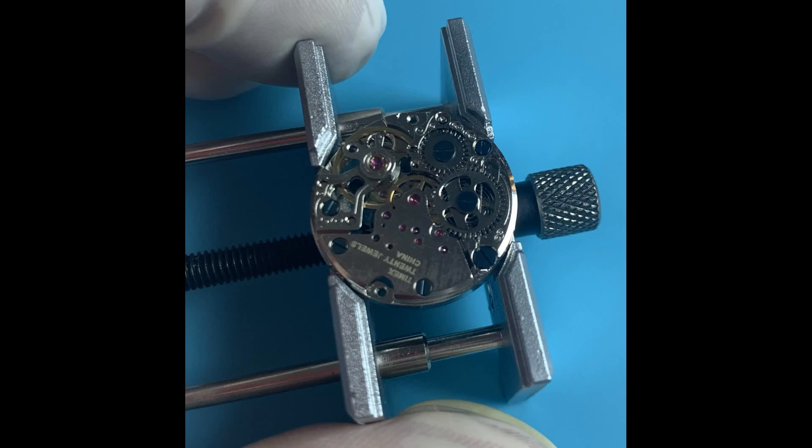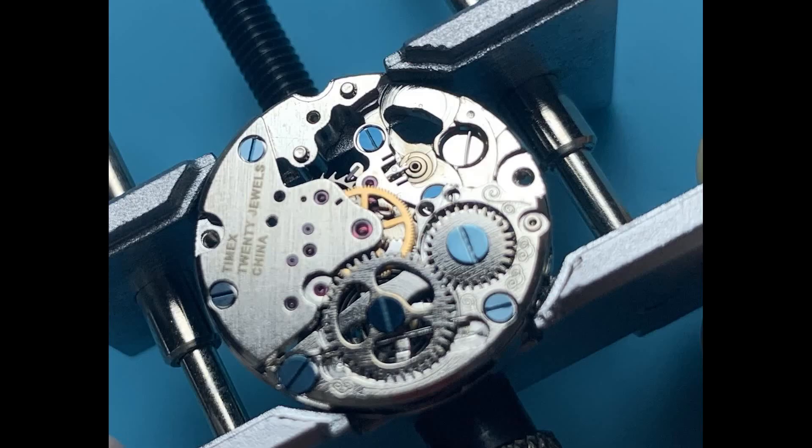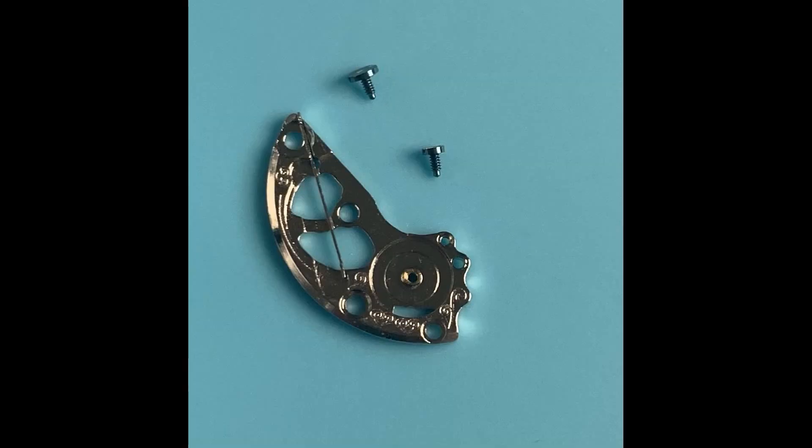Alright, here we are on the back — the other side of the movement. Here is the balance wheel removed, and now you can just make out the pallet under the balance wheel. Next I removed the ratchet wheel and the crown wheel. Note the crown wheel is reverse-threaded in this case, which is true on many watches, so you actually turn the opposite way to tighten and loosen the screw than you usually do. It's a small detail but something you definitely want to keep in mind if you get into watch tinkering. Here is the barrel bridge removed. That long strip in the middle is the click spring — this prevents the watch from unwinding and produces the audible click and tactile sensation of winding the watch.